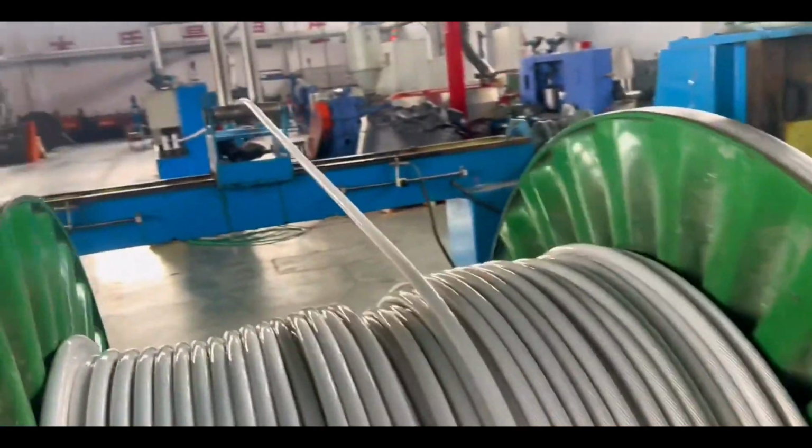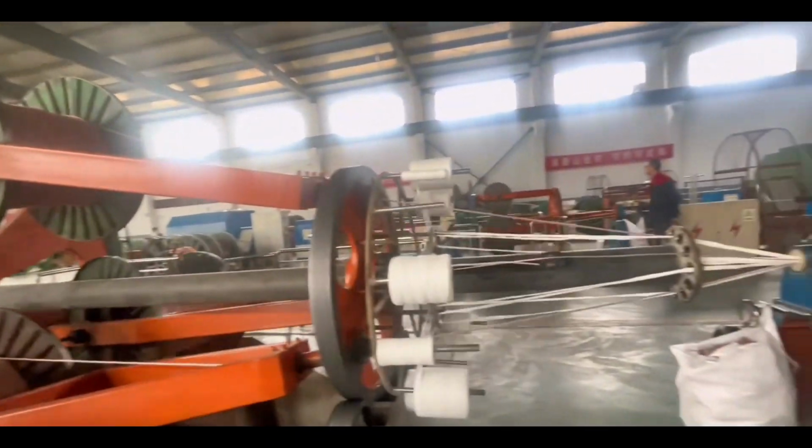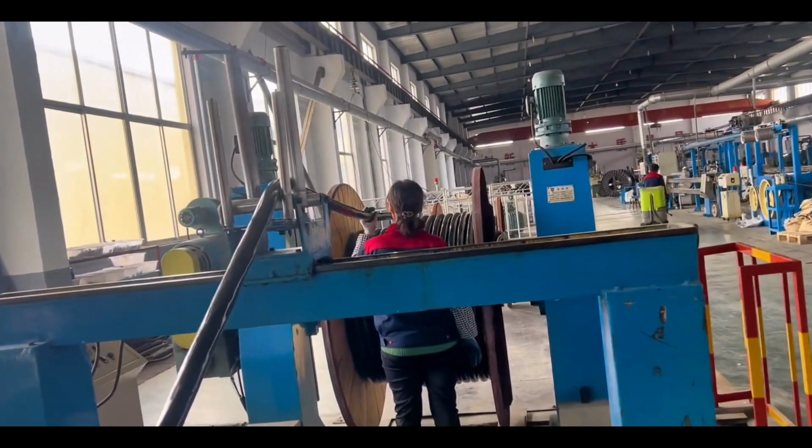After completing the extrusion of the inner insulating layer, these wires along with internal filling materials are finally twisted in this large rotating device before being sent to the final stage. In the outer protective layer extrusion, the cable is first uniformly covered with a layer of black polyethylene and then cooled. After detecting and printing related labels, qualified cables have been successfully produced.